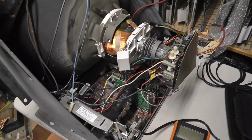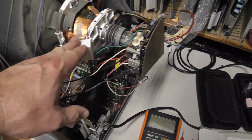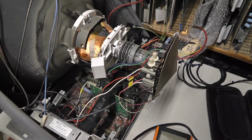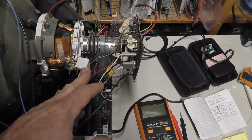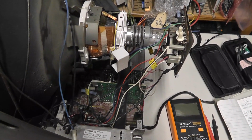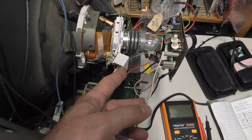We're looking at a 4600 chassis here, and on my last video that I'll link to, I had a donor tube. We did the resistance and inductance measurements on it, and I felt like it might be too far off for 4600, so I kind of chickened out and just went ahead and modified it from parallel wiring on the vertical side to series, and we swapped it with a 4900. I will, at the end of the video, update on the progress of that in the track and field cabinet to see if I can dial it in to a game versus the TPG.